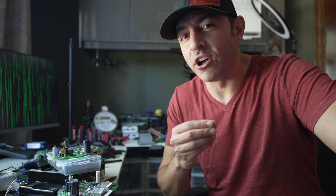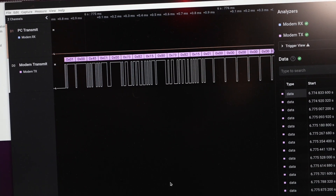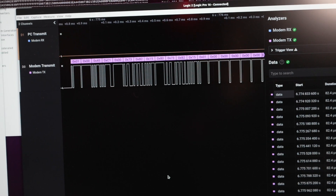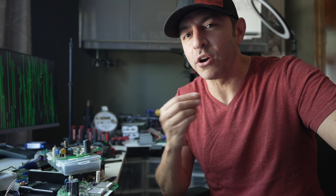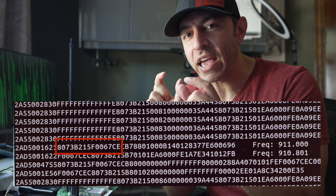Capturing that traffic with the logic analyzer and looking at the serial data, I didn't see anything obvious explaining why the light turned from blinking red to green — it happens kind of hit or miss. What I am trying to figure out now is whether these devices can see each other. When you look at the traffic, you can see a routed packet that contains both the meter's ID and this modem board's ID together, which suggests one device saw the other and is trying to send a message to it.